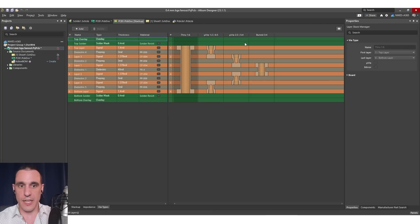Looking at our stack up, we have very thin outer layers — I've set three mils here, though you could go thinner with certain laminate materials, qualifying your stack up with your fabrication house. There's a standard thick layer in the middle holding the conventional buried via, and of course more layers could be spanned by that via — I've omitted them for brevity. With routing, we could have signals on the top layer; depending on layer thickness and copper foil we could have ground here in a co-planar arrangement, or two signal layers, though you have to be careful about broadside crosstalk.